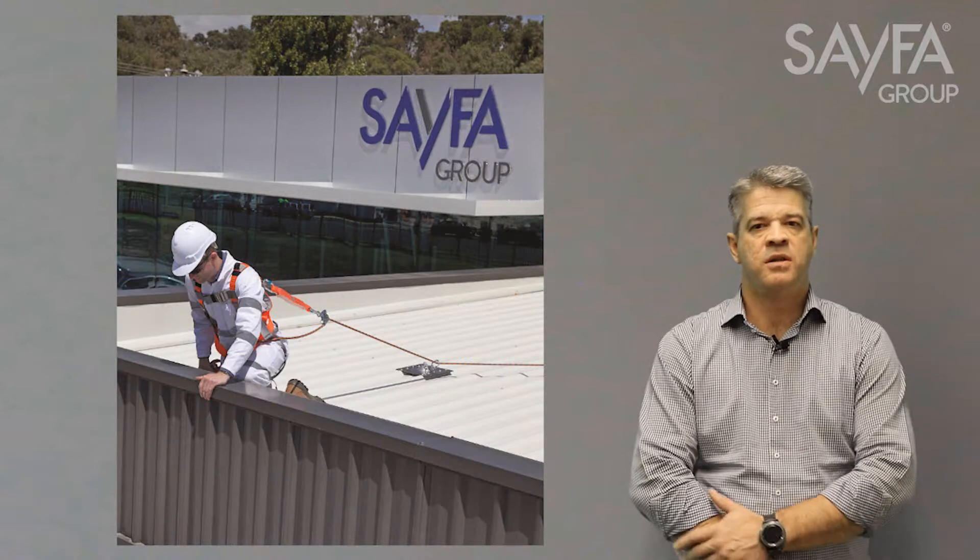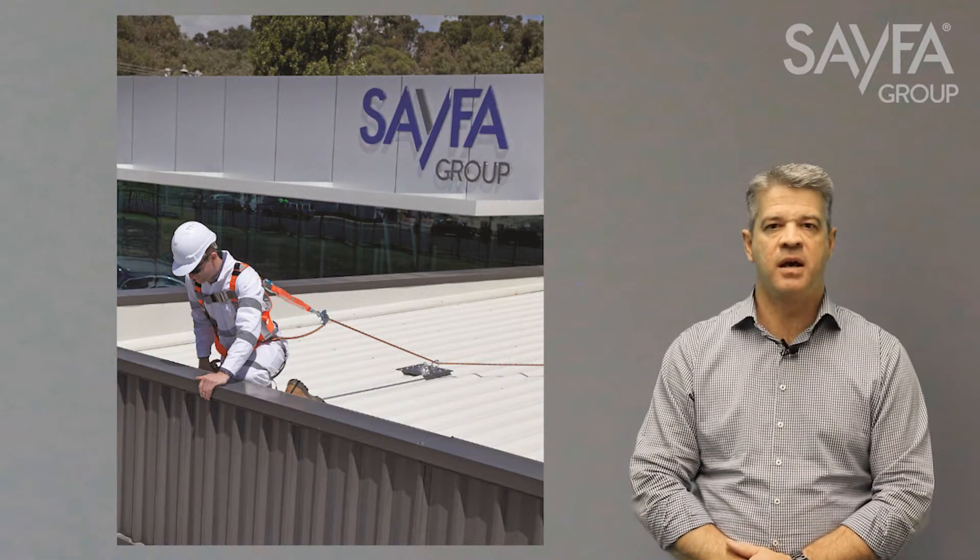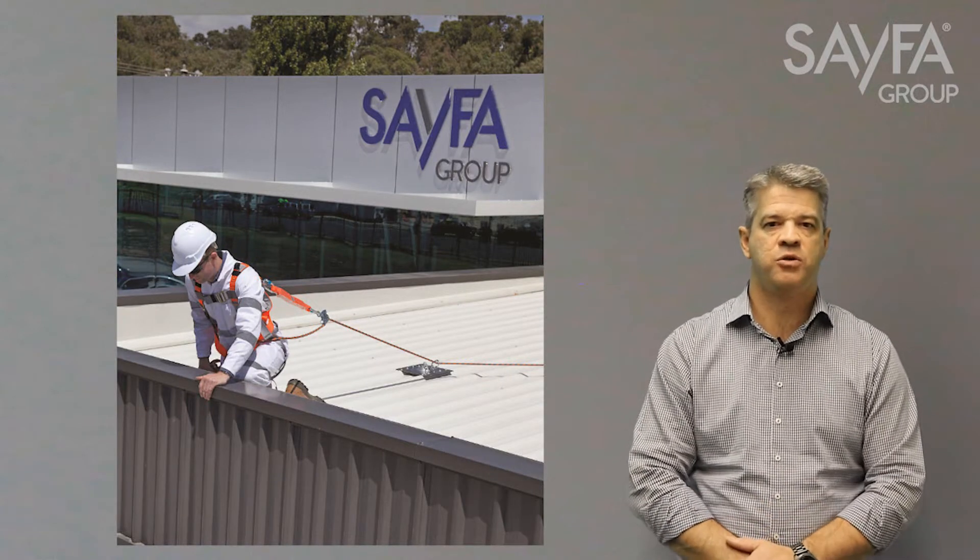Anchors have evolved and have been designed to attach to lighter gauge structures. Therefore, it's important to come up with the testing criteria for these types of anchors. In the past, anchors have been designed and rated but not considering the structure to which they're attached. The AS5532 standard has taken into account the anchor in its installed state, so that the testing covers the anchor and the roof structure to which it's attached. This is a very important part for surface mount type anchors.